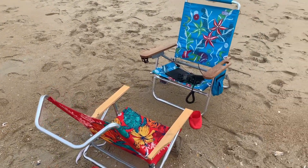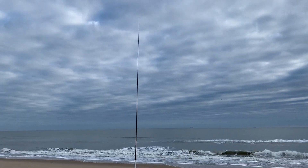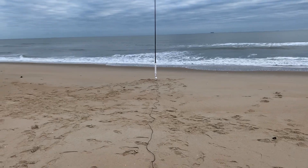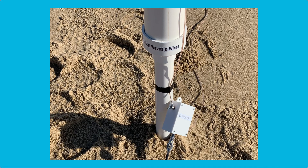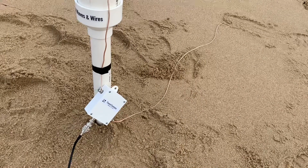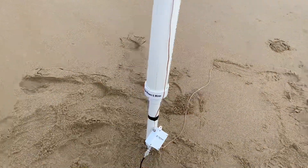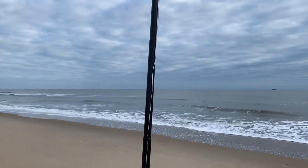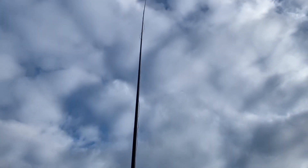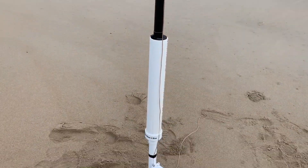Okay, here it is — all set up. It just amazes me how quick this DX Commander travel pole goes up. This thing really does go up very easy. I usually just extend the pole, lay it over my beach chair, tape the wire to it, then drop it in the sand spike and attach the Unun. It's really that simple. There's the 49-to-1 TennTennas Unun end-fed half-wave transformer. There's my Coastal Waves and Wires sand spike. There's the wire headed way up to the top of the DX Commander travel pole. Let's see if we can get some DX today. Wish me luck.